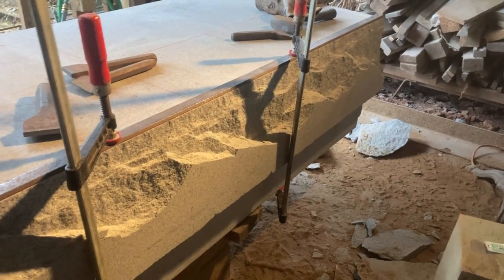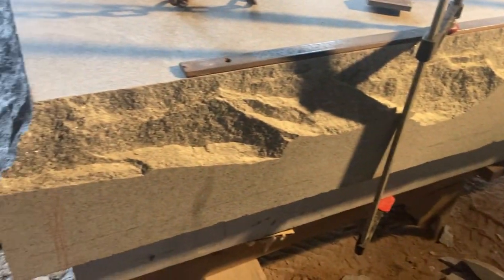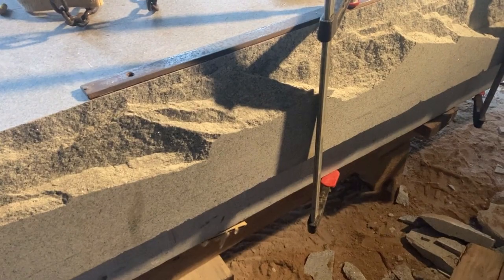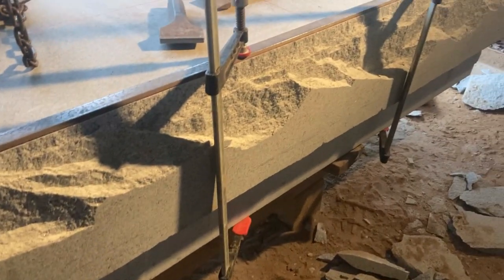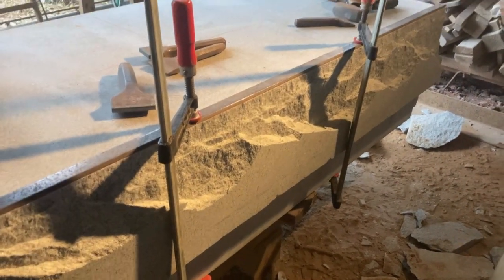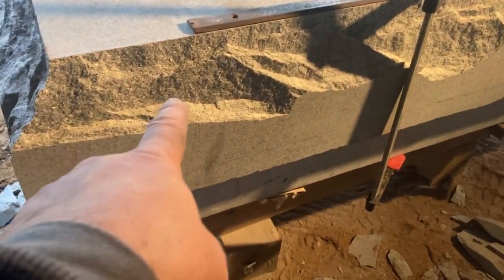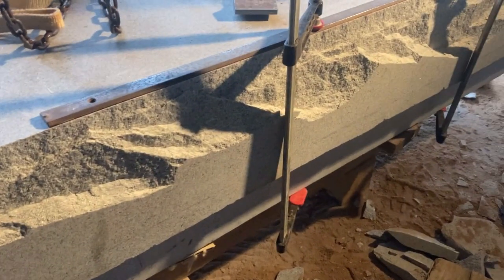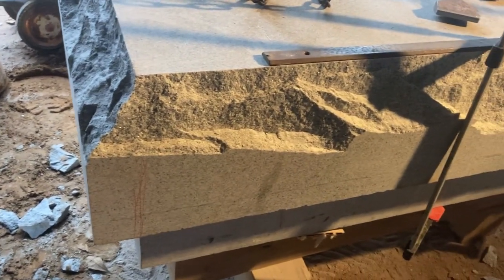When you have to do this, it's really important to put the stone in a position where you can use every bit of energy and muscle you've got. A big hammer works. If we had 2 people here, we could bull set this with an 8-pound hammer and clear it all off and it'd come off without any trouble. You'd be more at risk of breaking through. With a 6-pound hammer, you really get a lot more energy than hitting it with a 4-pound hammer, because the stone will hold and it'll isolate your energy in smaller areas and you won't get as good a break. But I think this is going to work pretty well.